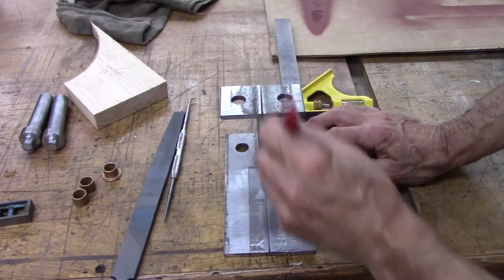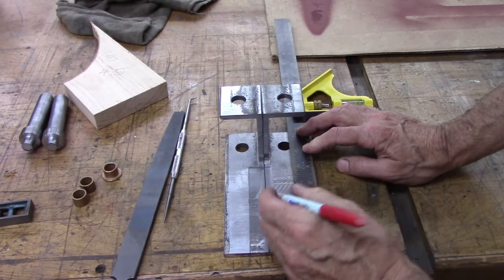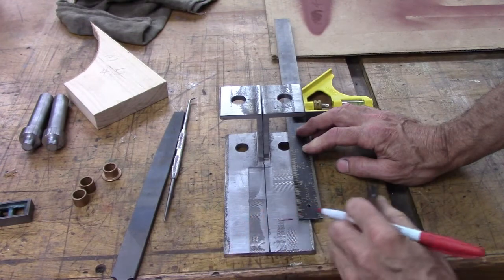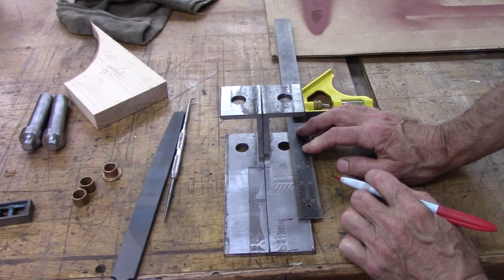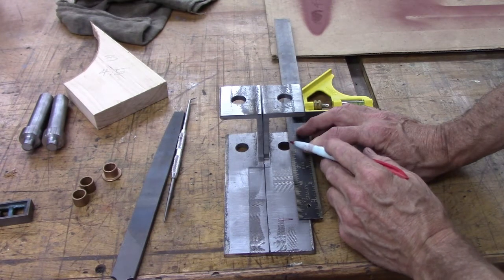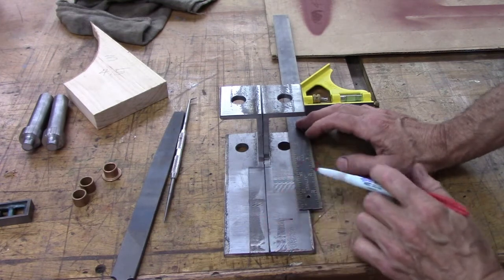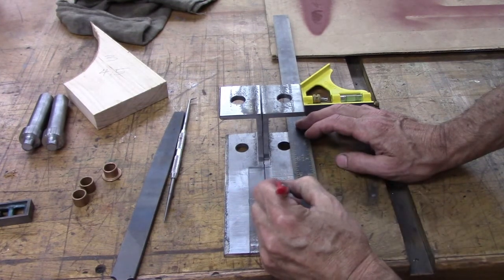But the steering control is 4.5 inches from this pivot point. So the steering rod, I guess you want to call it, ties it to the steering wheel. And then the tie rod between the two is 3 inches from this pivot point. So it's right there.